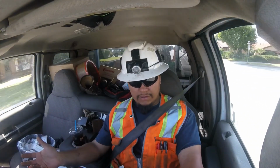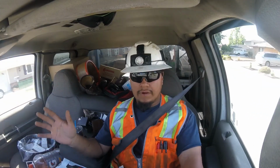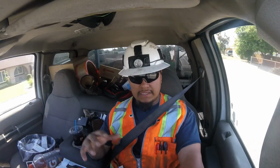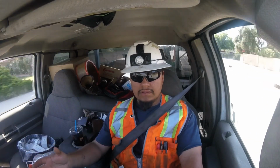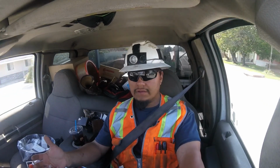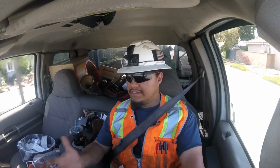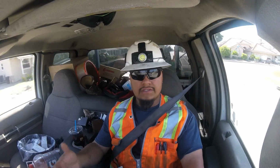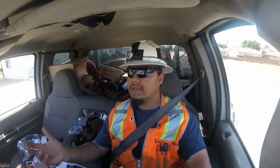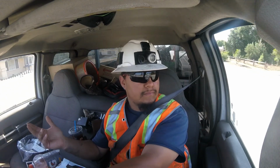However, I've already had to warranty a whole air end because it ran low on oil. It caused the machine to run hot, the oil temperature sensor failed, and the air temperature sensor failed. And the machine never picked it up. And it just ran it into the dirt till the thing failed. And that was it. It was gone. And we had to warranty a whole air end, unfortunately.